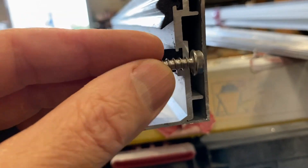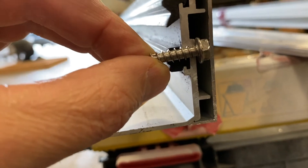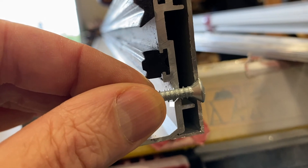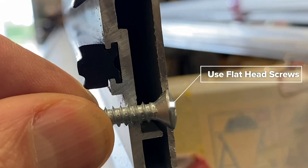Here's the bolt that holds the pressure plate onto the glazing system right through the rubber — the holes go through the rubber — and that you're not going to be dealing with. What you're going to be dealing with is screwing this cap into that pressure plate right here, and in just a minute I'm going to show you how to countersink and secure that screw.